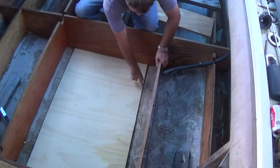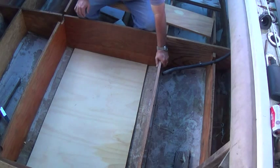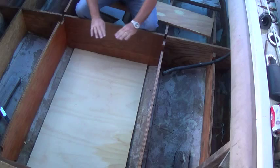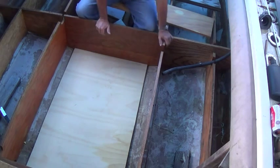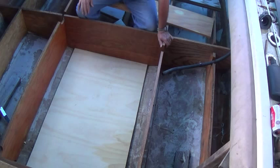But then there's a strap. What I'm going to do is run it clear across there — there's a piece of three-quarter-inch stainless strap that comes up around here, and they did the same thing for the back. I got this piece a little long; it's touching the transom, so I'm going to shorten it up. I got the measurements for my fuel tank — it's like 44 inches and this is 48. I'll back this up because I don't want to cover over the inside part of my drain to drain the water out of the boat. In the back here I want to make sure it's exposed on this side, just in case you get any debris or anything in it.